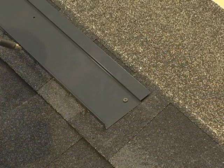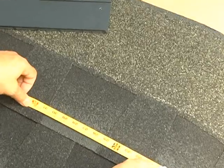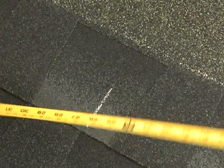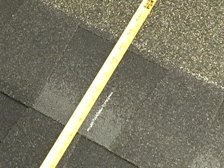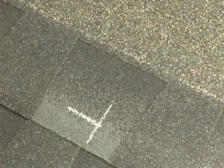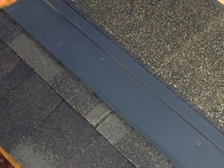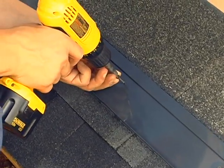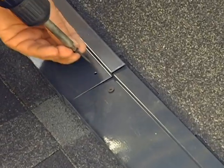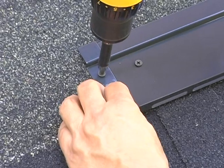The first step in the installation is to attach the starter vent. Using the layout plan, take measurements to determine the exact location of the bottom right corner of the system. These first measurements are crucial as mistakes at this point could result in a lot of unnecessary labor. Make a mark showing where the right corner of the first shingle will be placed. From that mark, measure 1¼ inch up and 1¼ inch to the left — this is where the right edge of the first metal starter vent will be placed. In the first course, each Sun Energy Shingle will attach to a starter vent which provides for cooling airflow under the system. The starter vents are screwed to the roof, butting against each other and running parallel to the asphalt shingles. At the end of the course, attach the 1-inch starter vent filler to complete the starter vent.